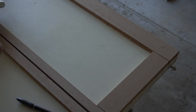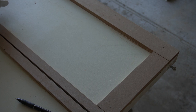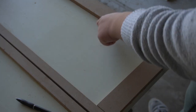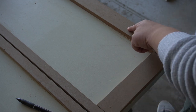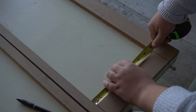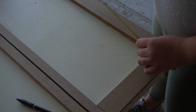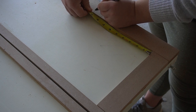To figure out this distance, we're going to take you back to high school. For all the kids who said they'd never use this math, I've hired a high school math teacher to explain it. Since we're going for a 45-degree angle, we're making a 45-45-90 triangle. On a 45-45-90, the two legs are exactly the same length — that's technically what we call an isosceles triangle. Since this length is fixed, we use it as the length of both sides. This comes in at 8 and 7/8 inches, so the other leg is also 8 and 7/8 inches, and we can mark that so we know exactly where it lines up.